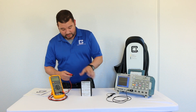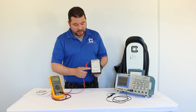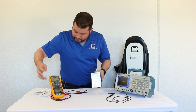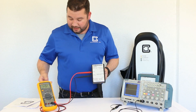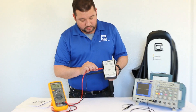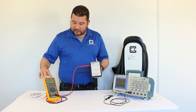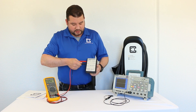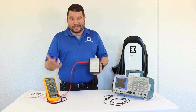We're going to plug in our meter and measure each line to ground, using the ports on the CP50. Then we'll measure line to line. I'll turn my meter to volts AC, plug into ground, then into line one. We should see about 110 to 120 volts — in this case we've got 113. Then measuring line two to ground, we should see approximately the same, and we do: 113 again. Line one to ground and line two to ground are going to be right around the same. Measuring line to line, we should see somewhere between 208 to 240 volts depending on the transformer configuration at the site, and here we've got 226 — exactly what we would expect to see.